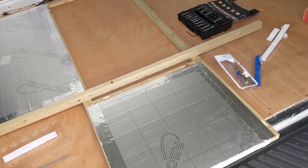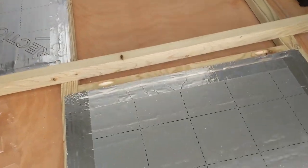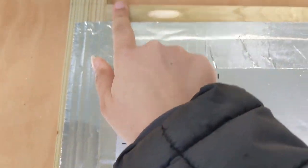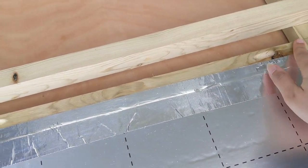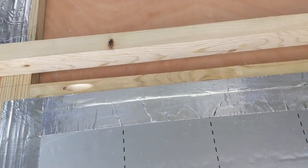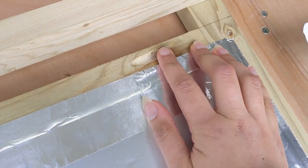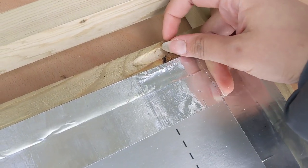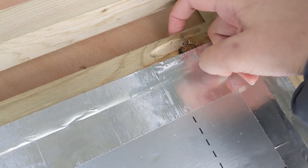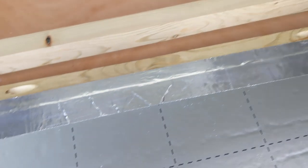This is our frame for our partition wall, which will be going just about there. What we're doing today is trying to route the groove where the frame of the door will sit. As you can see, we've already screwed in our pieces, which is possibly an error, and we also have these screw holes already cut in to join them, which really means we can only take off this much edge, and we need to go down by about 1.2, because these are 2.4 deep.